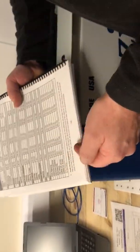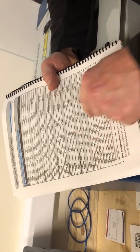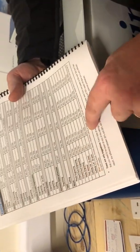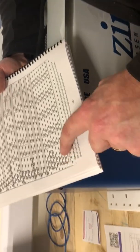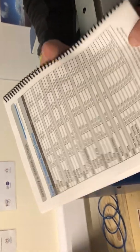But by going way too slow or way too much power, we could actually possibly put something on fire that way as well. Okay, so having this chart as a starting point is good, but you might have to tweak these depending on, that piece of plywood I had might have been a 4mm or 3.5. I haven't got anything to measure it accurately. Okay, so these are a good starting point. You would definitely start here, start conservative, and then work your way up from there.